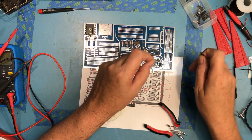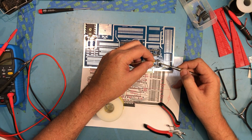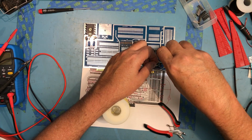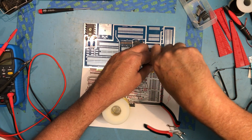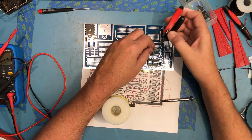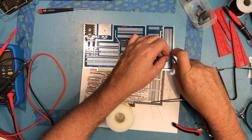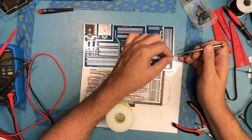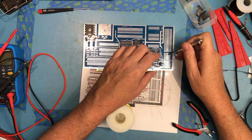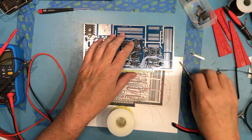And then we're going to take that pin. I've not done this for a long time, so I'm a little out of practice. And we're going to do a second wrap onto that same pin. We're going to bring that up here to the pin up here. You can see that wire wrapping a large amount of logic on a large board or multiple boards can be tedious, and it is. This is really how prototyping was done back in the day. That comes to clear, or power on clear there. So we've got those wires in place.